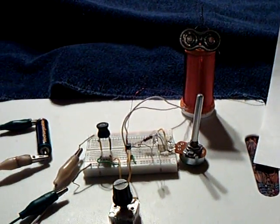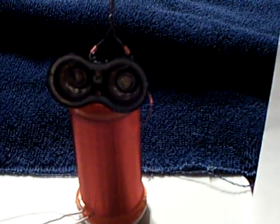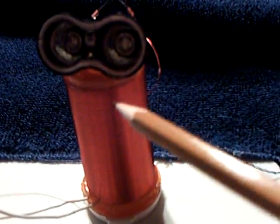This video is for Slider and I finally got around to building the Walgreen tower, which is just a pill bottle. It's a plastic pill bottle with 30 gauge wire wrapped on it, and it's got the primary coil inside the pill bottle — two turns of heavier gauge plastic-coated wire inside the pill bottle, and that forms the primary.